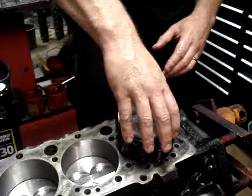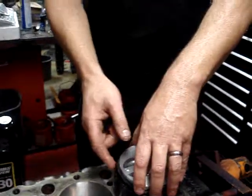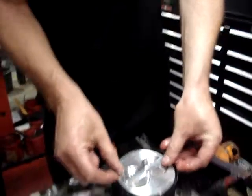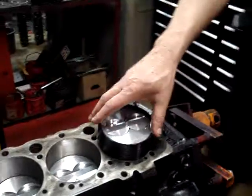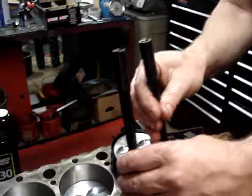You've got to be very careful when you go in here. These rings will usually start to catch on the edge of this compressor. So what we have to do is kind of work those rings in there. Once I get that in there, we also have to do something very important called putting a journal protector. This is a journal protector.